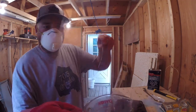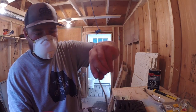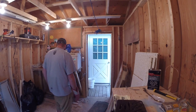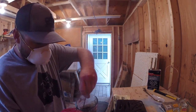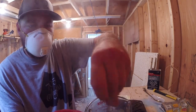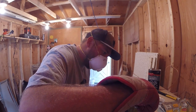I've put it in for two minutes — I won't need the whole two minutes but that's what I've got for now. Just keep an eye on it. Check it at the minute mark and give it a little stir — you can see it's starting to bubble. Give it a little stir, get the air out, mix it up. Get the plastic off the sides, get her back in — this will probably need another 30 seconds. Still kind of bubbly — mix it out. Now you've got a good liquid. You want to give it a slow pour and let it spread its way out to the rest of the mold.